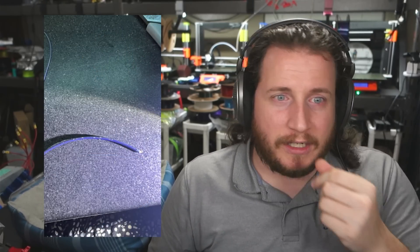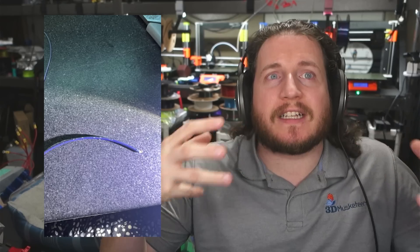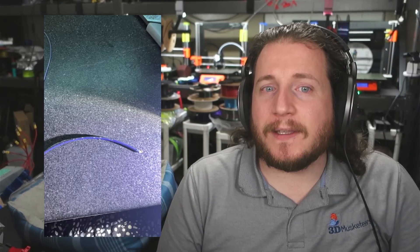That might sound like a lot, and it's likely more than you need, but I'd rather you change it more often than necessary than have you get stuck with really random failures that don't make a ton of sense. Allison from our Discord was going through a similar issue with her Prusa MK3S — it was just clicking and not pushing filament out. The MK3S has an all-metal hot end but uses a short piece of PTFE to guide filament in. For Prusas, you can just buy regular PTFE tubing, print out the cutter, and remount the ends yourself.